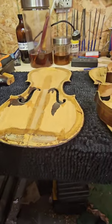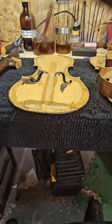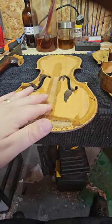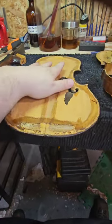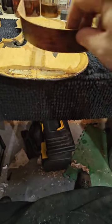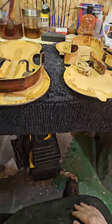The first thing that has to happen is we're going to have to de-glue everything — all this thick glue all around the outside and around the back has to be taken off and cleaned up. The seams on the top are separating a little bit and there's a piece of cloth on there that seems to be holding, but we'll probably take that off to clean up the big ridge of glue before we do the tone bar, and then put some cleats on there. Other than that, there are two little cracks on either side of the neck heel button that need to be worked with.